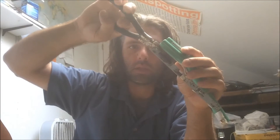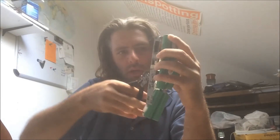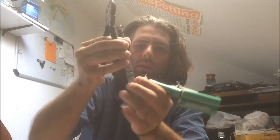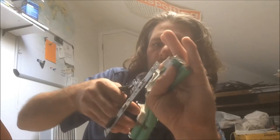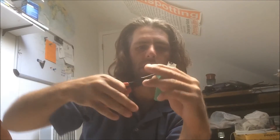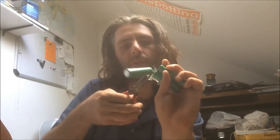Careful when you're pulling it apart, because sparks will fly — I've had that happen a bunch of times. Just use clippers to remove the charge board, trying really hard not to short anything out. There's also little leads for the temperature sensors and for the balancing leads. Just snip all of it fearlessly but carefully. And take your needle nose pliers — I'm taking off all of the tabs on all of these cells because I'm going to solder this whole pack together.